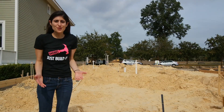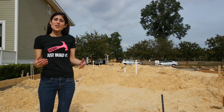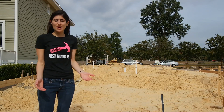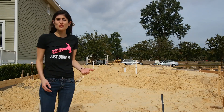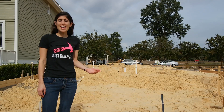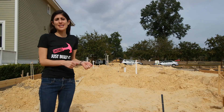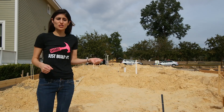One other thing to point out is that water is actually not free. The builder needs to contact the water utility — here in Gainesville we use GRU, Gainesville Regional Utilities — and they need to pay what's called a tap fee in order to tap into the water source to bring the water to the house.